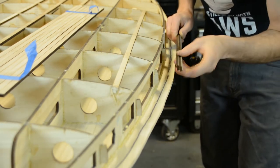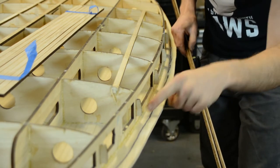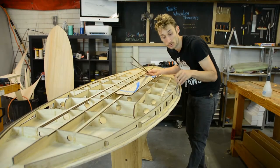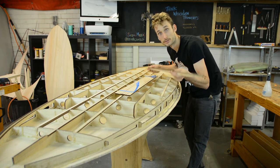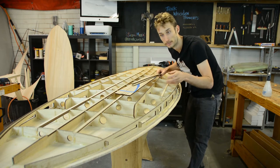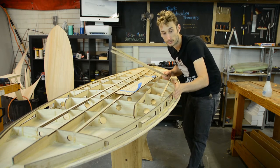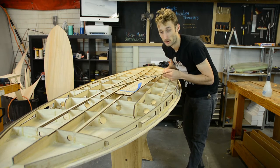There are a few things we do have to do at the nose and tail sections where it starts to thin out, but for the most part we just have to clean up all of this squeeze-out so that we have a nice glue surface to apply clamping pressure. If you're using the complete kit from our website, we supply all of the 12 by 6mm strips in shorter lengths. However, for customers opting to supply their own timber, you'll need a 12 by 6 or 12 by 12mm strip that can run the whole length on both top and bottom — about 12 meters of material all up.